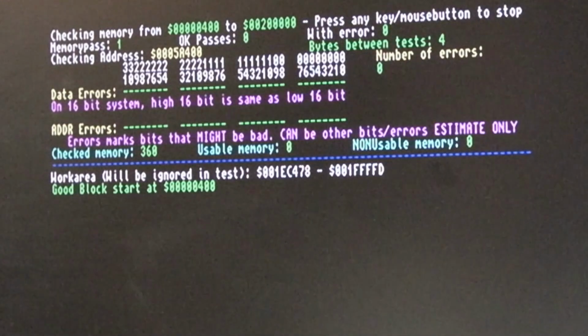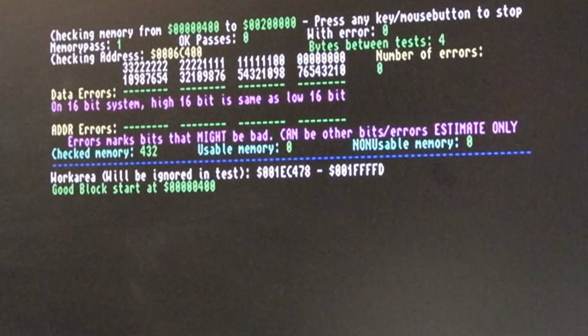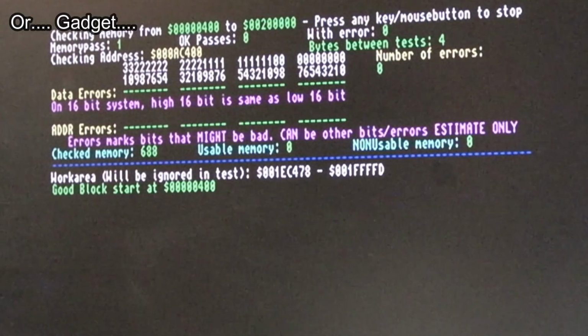I was measuring the voltage on the op-amp, and on one side you've got like plus 12, on the other side plus 5. It's really weird how they've done it on this. I would have thought you'd use the +5, -5 and then just boost it at the stage with some transistors or something. It's a bit odd to me. But anyway, I'm not sure why the volume's not right, it sounds really noisy. I've got the TV really loud. So we've got a problem there. It could be the op-amp that's dead, it could be a component sizing not right, or I don't know. I honestly don't know. It's a bit confusing.